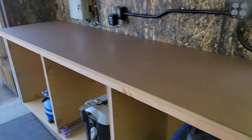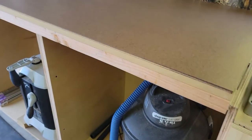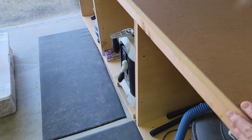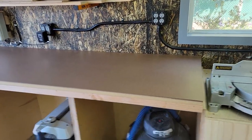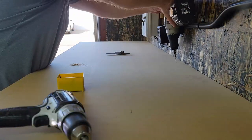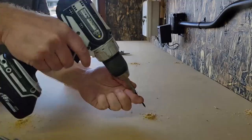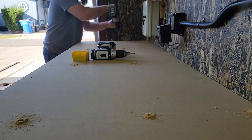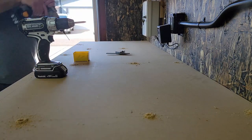A little preview of what it'll be — it lines up with the miter saw base straight across. I ended up having to get eighth inch hardboard because they didn't have quarter inch for some reason, but I'll trim the front and the ends with the maple I got, and I'll have a nice workbench area here. Time to secure the top down to the two by four base. Just pre-drilling some holes, measuring it, trying to keep clearance for the T-track I'm going to put in so there are no screws when I run my router through. That black and white Makita drill — I've had that thing 15 to 20 years. It's been a really great drill.